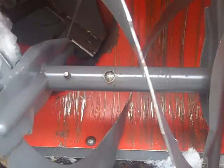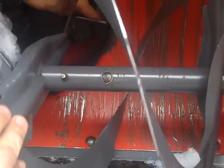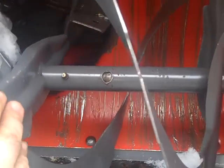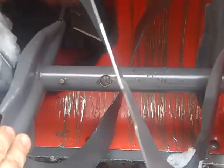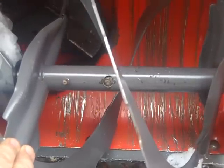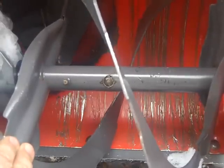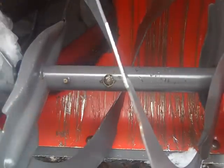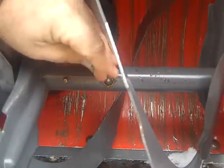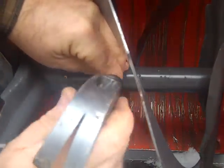Of course, you can fight and try to hammer the thing out. Or you can stick your hand into the auger like a maniac and turn the stinking thing. Put your hand right in the tines. Here it comes. Now you want to tap that out — could use a little drift pin or something like that. I like using a nail and a hammer.